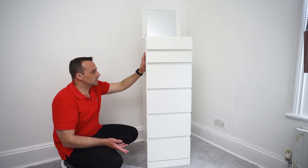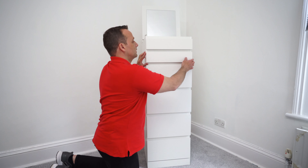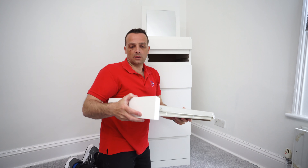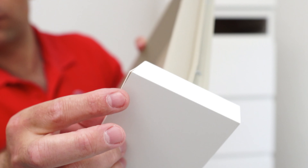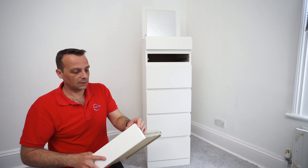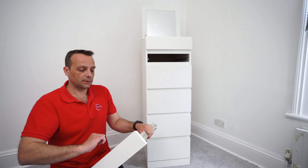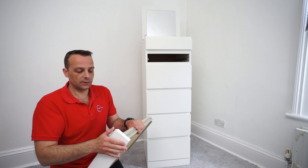Securing it to the wall is a good thing. The materials are the usual IKEA cheaper materials. You can see here in the corner that the tape on the top is coming off — but there is an easy fix. If that happens on any part of your IKEA furniture, just get an iron, heat it up, put a sheet of paper over it, and iron it for just a few seconds until the glue gets hot.